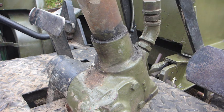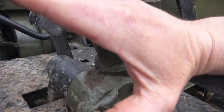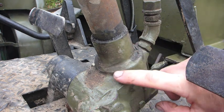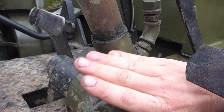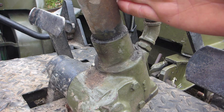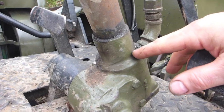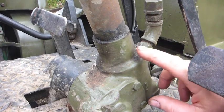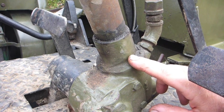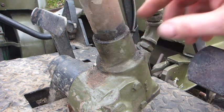These boxes were typically used on commercial vehicles where they were inclined at a much greater angle. Therefore this top bearing — there's a bearing on the top and a bearing on the bottom — would have been more immersed in the oil, and as you steer the oil gets dragged around. However, in this very upright sit-up-and-beg position in these dumpers, the top bearing really doesn't get that much oil. So if it doesn't fail through wear because it's not getting oil, it'll fail because of rust and corrosion forming in here and running down, and it rusts away.